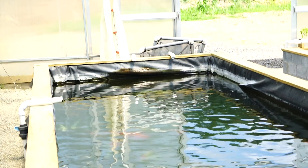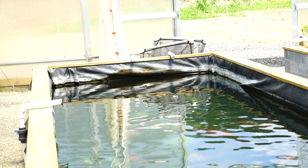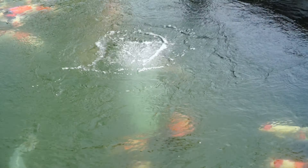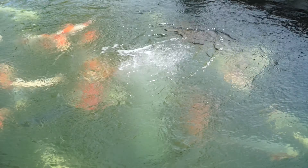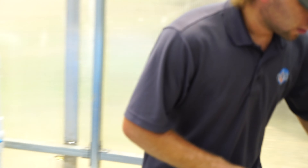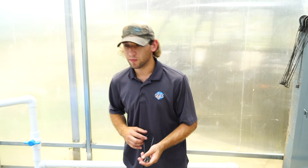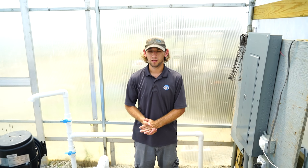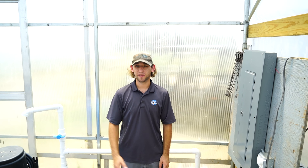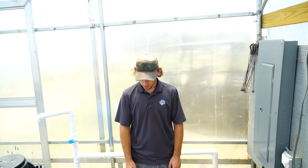These are what you call aerated bottom drains. The intake is from the bottom of the pond, so it sucks up all the fish poop and everything that settles at the bottom. The aerators create a sort of mushroom cloud effect — they basically circulate the water and fish poop back down to the bottom drain. Each bottom drain draws about approximately eight feet in diameter, so that's why we have two. We have no settlement on the bottom whatsoever.